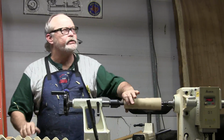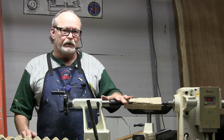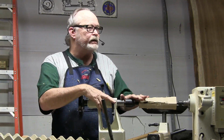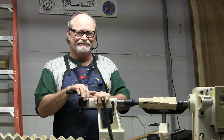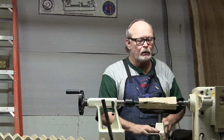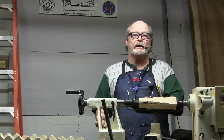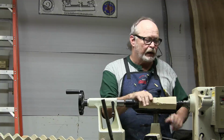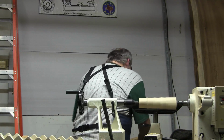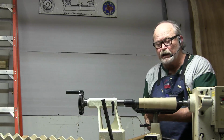So I work with little kids. I've worked with kids as young as 3.5 years old. I wouldn't put a 3.5-year-old on a drill press, but I'll put them on a wood lathe. It's the only machine where you hold onto the cutter and you're pushing it away from you, and with these kind of centers, I worked a lot with 8 to 10-year-olds, and they never touch this. I touch this. That determines how much drive. But when you're learning something like the skew, you don't want to wreck your nerves. Matter of fact, I have people practice dig-ins to understand it, and if you understand a dig-in, you won't get dig-ins, okay? Runbacks are another critter. We'll talk about those too, but I did have a skew. Here it is. But I mean, you can get plenty of drive from it.